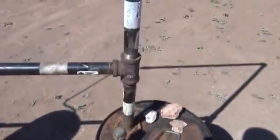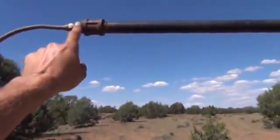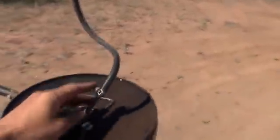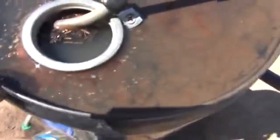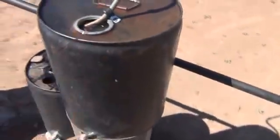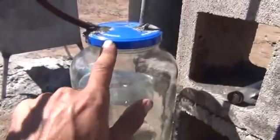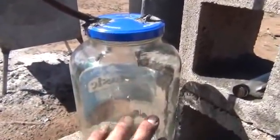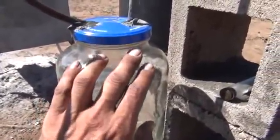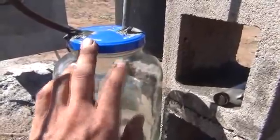It goes down that pipe from a reduction point here into another T. This is our secondary catch. It comes up the hill here with the lighter gases, not yet condensed. It rises across, loses a lot of energy, and is now once again restricted into a quarter inch copper gas pipe. That runs down here — and as you can see, that's full of nice cold water with a little bit of pine needles from the pond. I've got a nice 20-loop condenser coil inside of this 5 gallon tank. Running out the bottom, you see the pipe running out here into the top of this 1 gallon pickle jar. The next pipe comes out of the top of the jar — we're not putting it down too far because you don't want it bubbling once it starts to fill with crude oil.